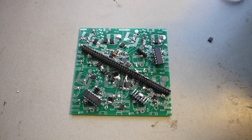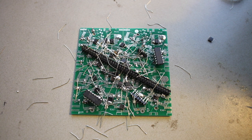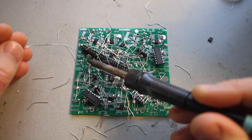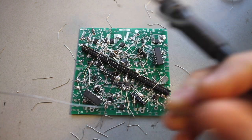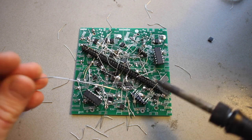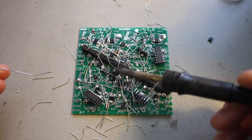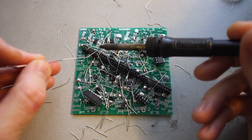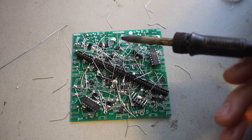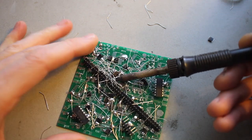So now we still got the resistor legs that are in the bag, so let's just put those over it. I like to tag them also a bit to the circuit board, because later when we have to solder the big blobs of solder still, it's nice if they're also over this. Here you see they're over the big header. It's nice because then it becomes a bit three-dimensional.